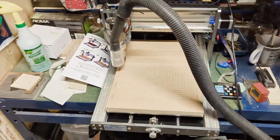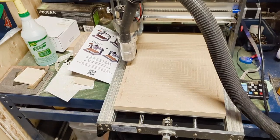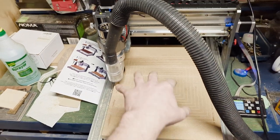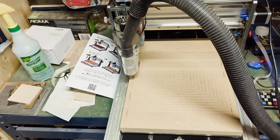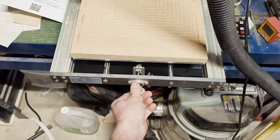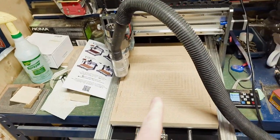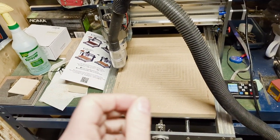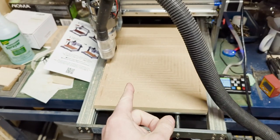Anyways, I hope this video was somewhat value added for you. I know I missed a lot on the reassembly process. Follow your instructions. Make sure you get this all back together properly. The orientation of the new and old plates and that black reinforcement plate that connects them is super critical, so follow the instructions for that. And be careful when you go to remove your Y-axis lead screw that you don't rocket the spring-loaded lead screw nut, the anti-backlash nut, because I lost a day looking for that, and that was very frustrating. I actually ordered replacements just in case it ever happened again, and I'll have them stashed in my spring drawer.